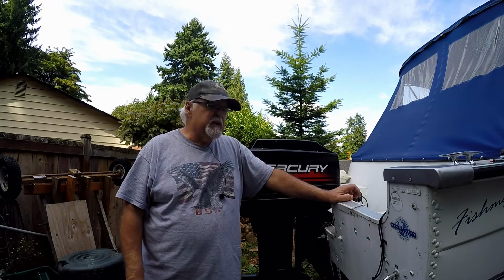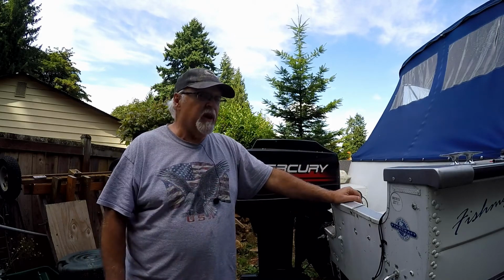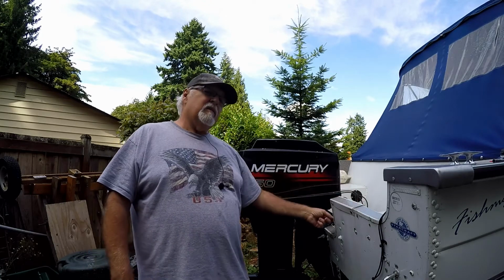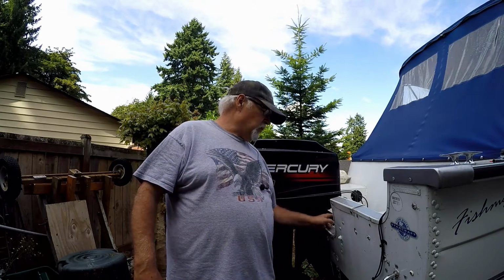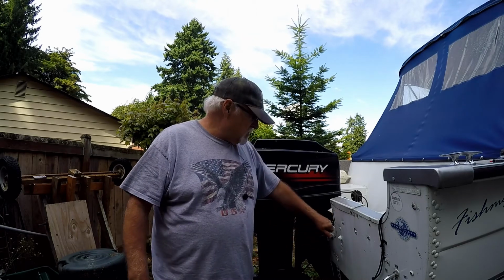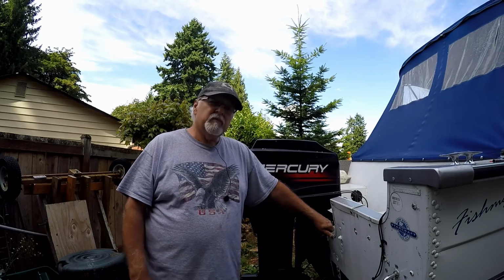Yeah, it was kind of scary at first when I went to pull that thing out, and I'm going, oh no, I'm going to have to pull the whole engine up to get that, because I saw another video where that guy did that. He pulled the engine loose to get the cable through there. But then I went, man, that's a lot of work for that. And then I looked at how much I had to clear just to get the rigid part of that steering cable through there, the nut. Because of the nut, you can't take it off. It's there. So I looked at it and I went, man, I only have to take that much off, and the boot and the retainer are going to cover it anyway. So what the heck? So I did, and it worked out great.